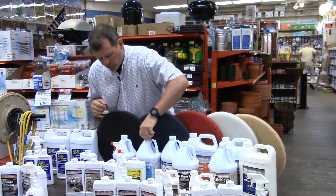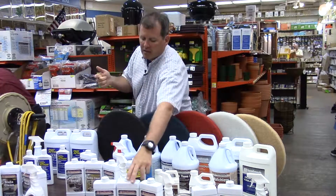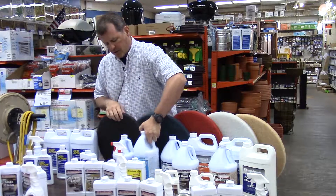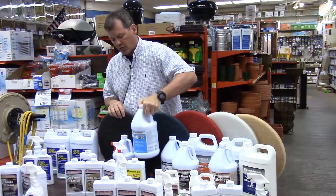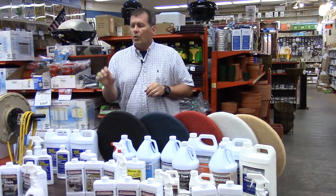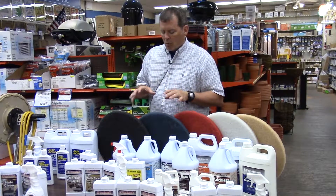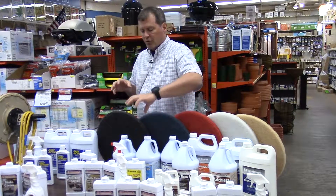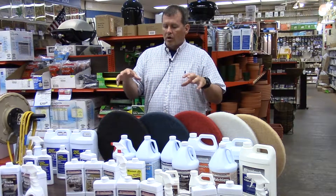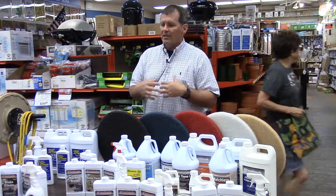The next thing you want to do is clean the floor really well. So we've removed — now we're cleaning. On the retail side we have our All-Surface Floor Cleaner, and on the commercial side we have Preferred, a great neutral concentrated cleaner. You're going to use it with warm to cold water — not hot water — because you want to remove all the warm water with the stripper that was in there, so you mop that clean.